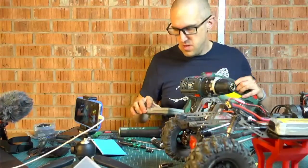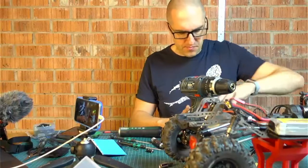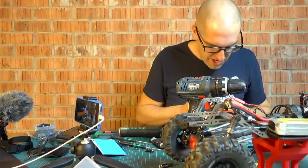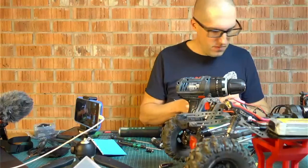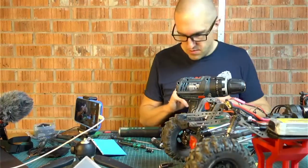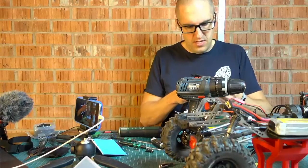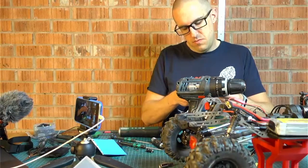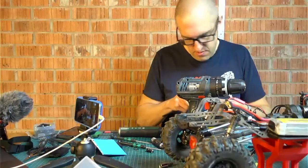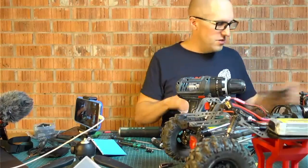Okay, cool. So I've got a load of grub screws, and what I'm going to do is just measure those up just to make sure they'll fit. Hopefully some of these will be M4-ish. Now if these don't work, I might get the Dremel out and just do some threaded rod. But if these are M4, which they are, and they are give or take 16mm, they should do the job. And in fact these ones here, I've just spotted, are 20mm. So I'm going to use the 20mm ones.